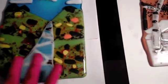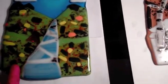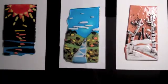Eventually it softens and rounds the edges of the original shape. Once the desired effect has been achieved, the kiln temperature will be brought down quickly through the temperature range of 1500 degrees Fahrenheit to 1063 degrees Fahrenheit in order to avoid de-vitrification. It is then allowed to cool slowly over a period of time at a specific temperature point to prevent uneven cooling. This cooling takes place over a period of 10 to 12 hours and is usually in three stages.